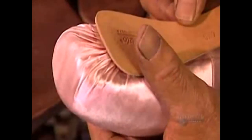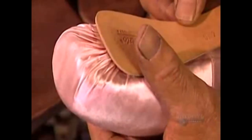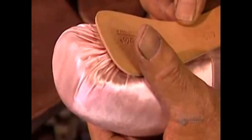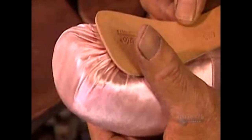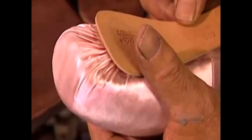They apply a foam filler to even out the shoe's underside, then coat it with high-strength vinyl glue. They apply the same glue to a sole, then leave both to air dry. 24 hours later, they put them on a heater set to 93 degrees Celsius, which reactivates the dry glue in about half a minute.